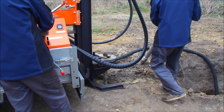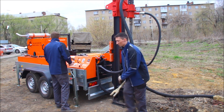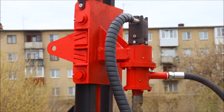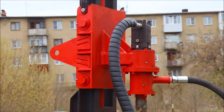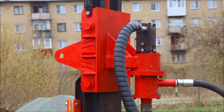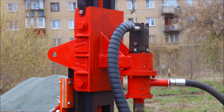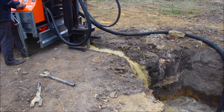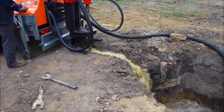The third drilling pipe is installed to the drilling string. This model, the GBU60L, is equipped with an air bearing unit, which allows operating the machine with an air compressor. Right now, you can observe the wet drilling of this drilling machine. Wet drilling means that you use the mud pump installed on the bottom of the drilling rig and the water pit, and you flush your borehole with water.